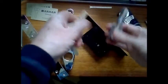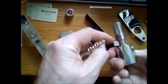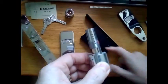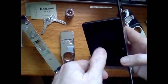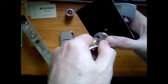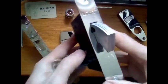This is the fiddly bit — you have to fit these in and it's not easy. You've got to make sure the cam is downwards; this little cam here has to be down, and that solid part has to face towards the front plate when you put it in. Then turn it till it sort of sits. Get your key, throw the deadlock — you always have to turn it a little bit more as they're a little stiff, but they ease in time. That bolt is very, very strong.